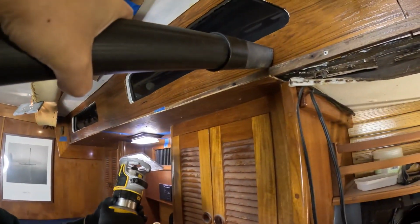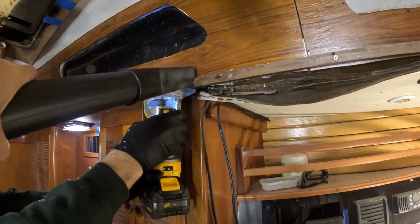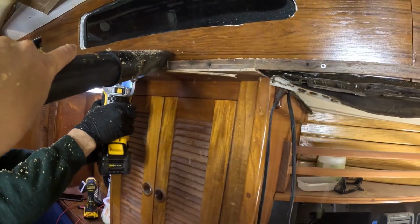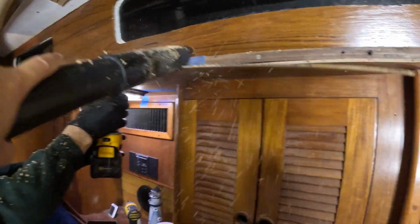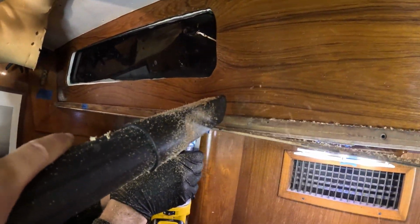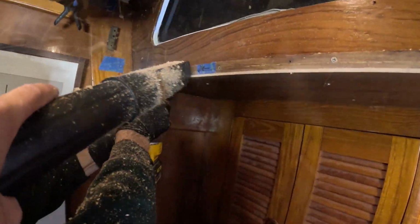One of the other things we accomplished on last week's video was we went ahead and trimmed off that forward excess edge with the flush trim bit on the router. Let me tell you, that stuff made a mess. It went everywhere. The vacuum really didn't help. I think we have a lesson learned on that one where we need to pull that little fine tip nozzle off the end of that, and we probably suck up a lot more debris doing that. But all in all, it was fun, and yes, we made a mess. But that's all part of the fun of working on the projects, making a mess so we can clean it up, right? Anyways, trimming that edge off turned out really well. Everything looks good. So that worked out well, huh? Didn't make a mess at all.